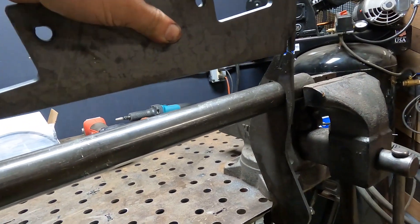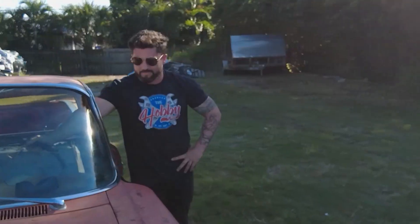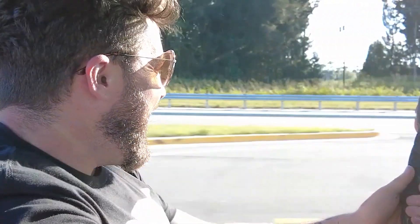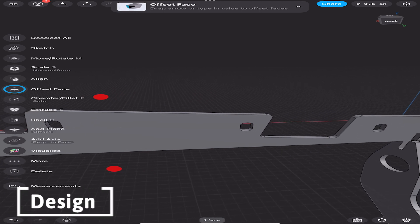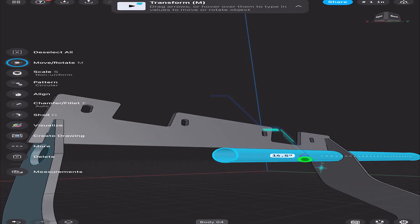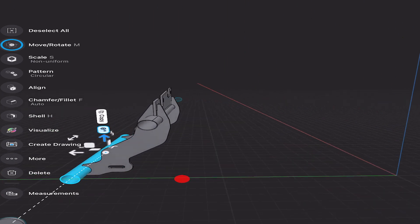This will keep the structure together as I'm starting to get it ready, so I have to make a reverse jig. What we have here is an actual tab and slot system I designed that is the fixture and the real piece all in one. This is going to help me later on when I actually put it together — you'll see that these things pop together like a puzzle piece. They hold themselves still and keep the articulation perfectly how I designed it. That way I'm not fighting with it while I'm building it, and then when I go to weld it, it's already popped together.